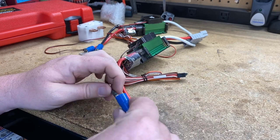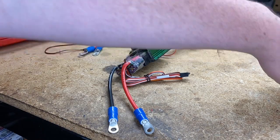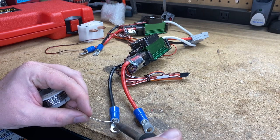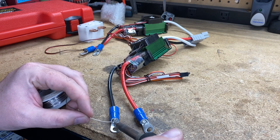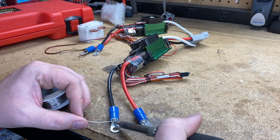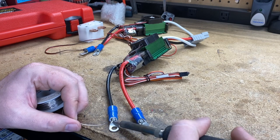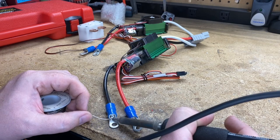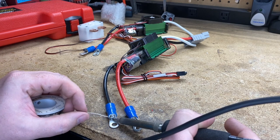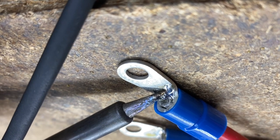Normally these are just crimp connectors that you put the tool on and smash, just like my Andersons. But something I personally do, because I just don't trust anything in the arena, is I actually put a little bit of solder on this end — so it's kind of like a mushroom. This helps them not get pulled out when the battery is dragging behind the robot and this connector is the one and only thing keeping your robot in the match. I don't know any other teams that do both a soldering step and a crimping step, but this is personally what I do with Scorpios.